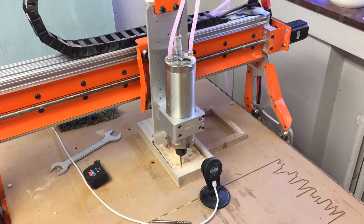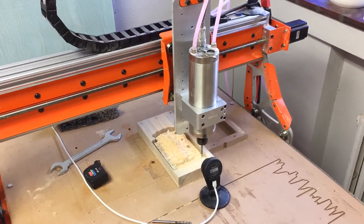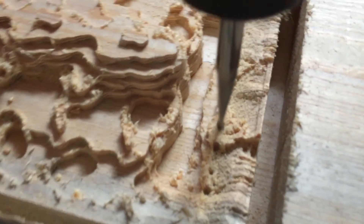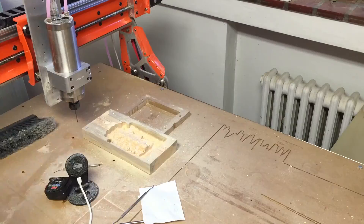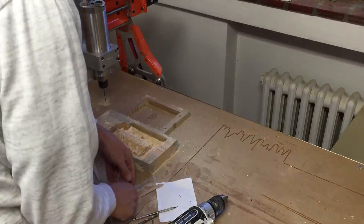To keep that dust down, keep my lungs safe, and keep it out of my eyes, I use a Nest security cam to monitor the CNC room, which is literally 25 feet away in the other room. Here we begin the 3D finishing toolpath, which is scheduled to take 9 hours and 45 minutes. This is where the tapered end mill is removing four-hundredths of an inch to reveal the tremendous amount of detail in the original 3D model.